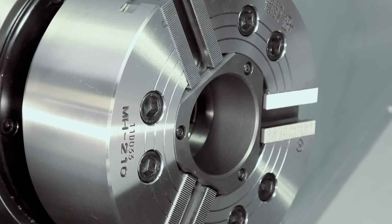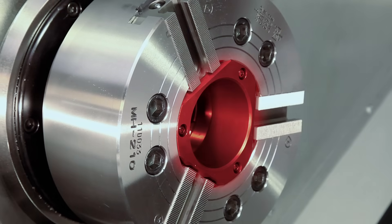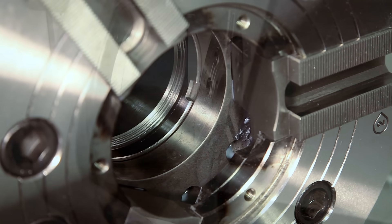While we are working at the chuck face, it is worth noting that you should never operate the chuck with the cover plate removed in an attempt to gain additional part clearance. This cover protects the internal moving parts from contamination. If contamination occurs, chuck life can be significantly reduced.